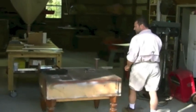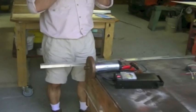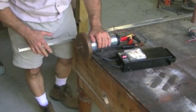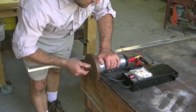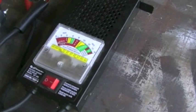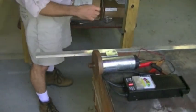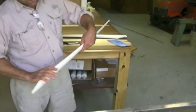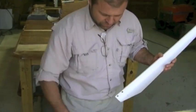We're going to start with the motor out of a treadmill. It is a permanent magnet motor and it also acts as a generator. You can see I can spin it by hand and I'm getting over four volts. The problem with using a treadmill motor and trying to hook the blades directly to the flywheel is that it will spin clockwise, which unscrews this flywheel.